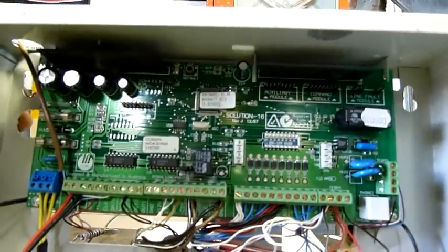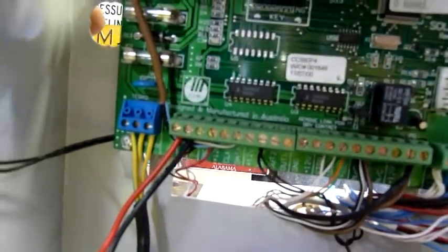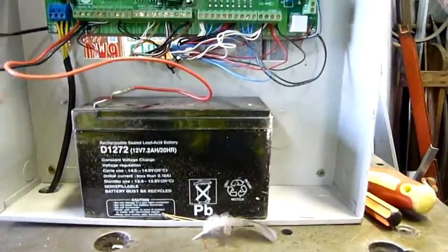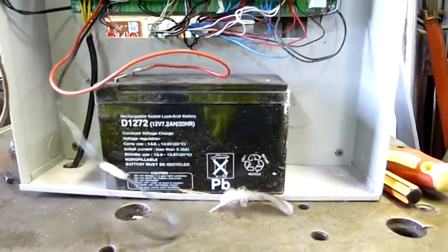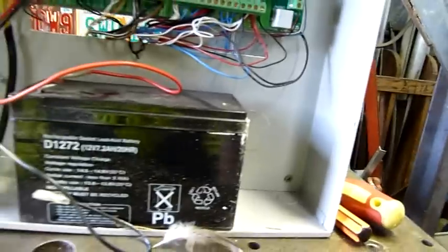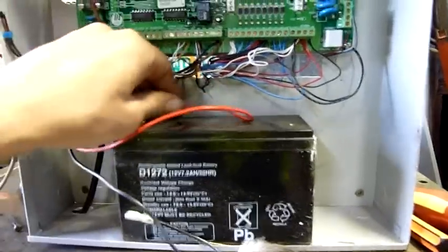As you can see, there's a nice little digital board there, designed and manufactured in Australia according to that printing, which is really nice. There's a dead SLA battery — I've just checked and it's holding 13 volts but there is zero current; even if you short it out you don't even get a spark. So that one's toast. I'll probably try and rejuvenate it but I've already got a dozen of them I don't have a use for.